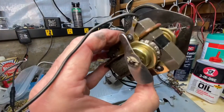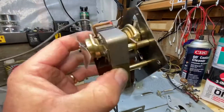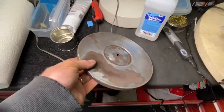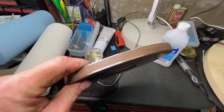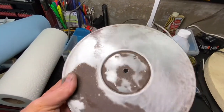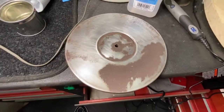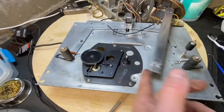That's fixed - glued that down nice and even. Should be fine, it's just a spacer. There's the completed motor, all back together, cleaned up and lubed - everything moves well. I went ahead and removed all the flocking from this thing because it was starting to flake, and I found some rust spots underneath. I took a little scraper, scraped off as much as I could, then took some 400 grit sandpaper and sanded it, then rubbing alcohol before getting some new flocking on there. I'll order some and make that look new too.